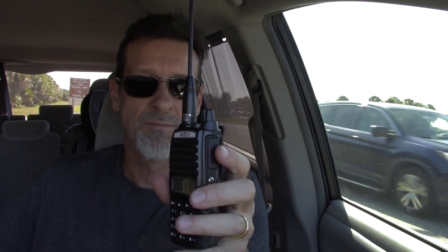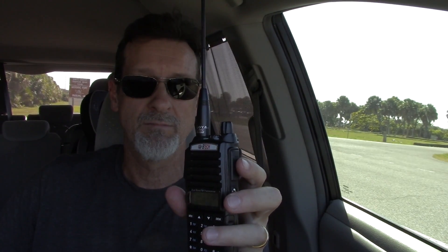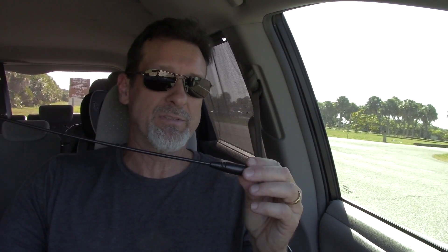One more time with the little one. Testing 1, 2, 3. Testing 1, 2, 3. I think the bigger stick does improve it - it's either getting out better or it's hearing better. I would think it would hear better. I'm not sure what SWR is on this at GMRS and I don't have the equipment to test that accurately. I would think more metal is going to hear better regardless of the frequency. Transmission - which way it goes, what the electrical wavelength is on that frequency matters on how it gets out and what angle it actually sends at.